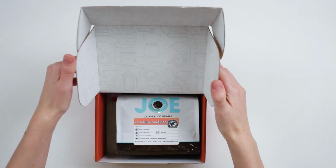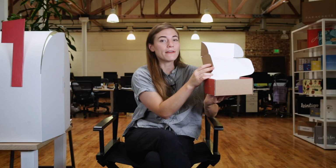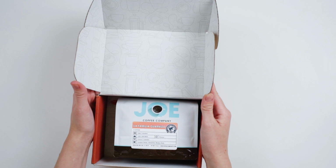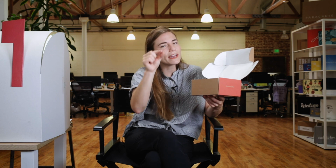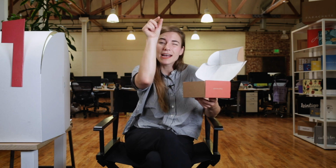What they're doing is very clever. This piece of corrugate has a white liner. It's Kraft on one side and white on the other. But this has the appearance to me of mottled white. Mottled white is a really common white liner paper that's used, and it's actually only 25% white, meaning if you looked at the thickness of the paper, it'd be 25% white and 75% Kraft.